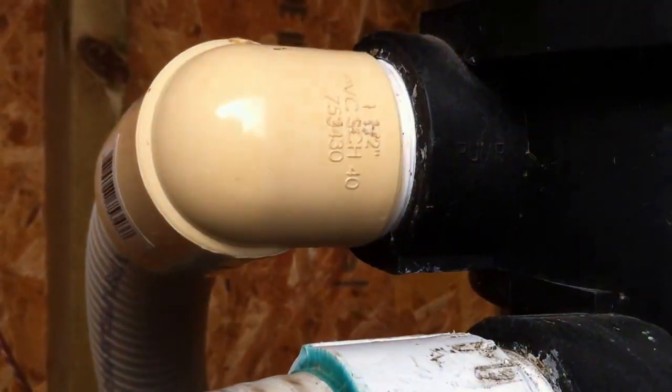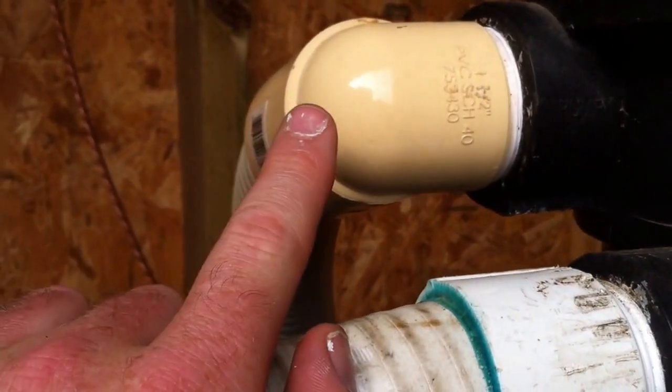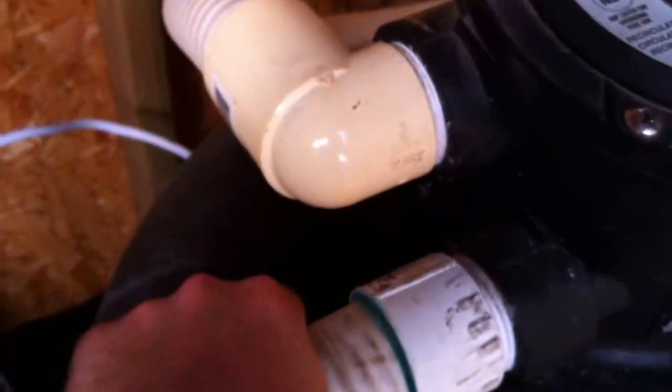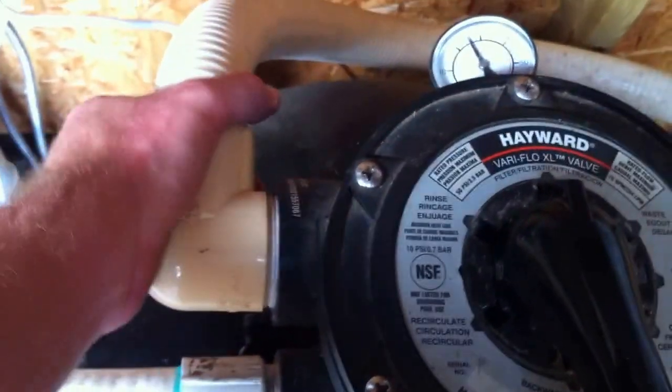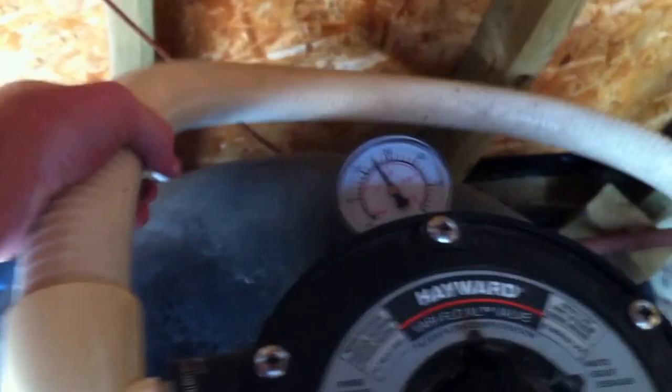What you should have here is an inch-and-a-half threaded male adapter that goes in, then a union fitting, then a sweep elbow. The union fitting would allow you to adjust the threads if you needed to crank it up because of a leak developing — and that's what's happened here — but there's no way to tighten this; if I tighten it more, it's just going to put extra strain on that pipe. The pipe itself hanging in free air is likely the reason this has been tightened and then slowly backed off due to the weight. With this pipe full of water it's actually pretty heavy — this should definitely be attached to the wall, or better yet rigid piping out to the wall and down to the pump. Everything nice, secure, firm. I don't like free-air pipes, and I certainly don't like free-air SpaFlex pipe.